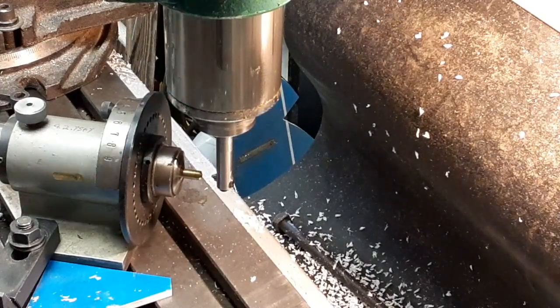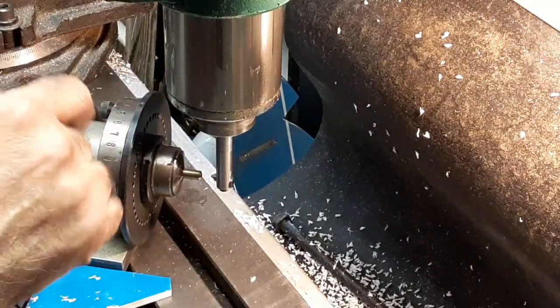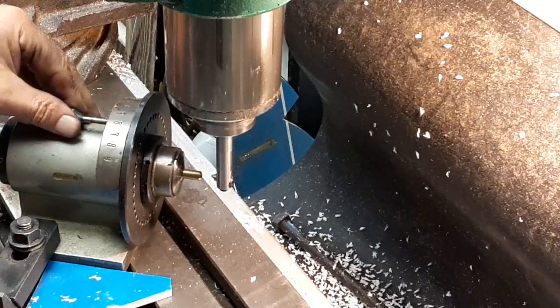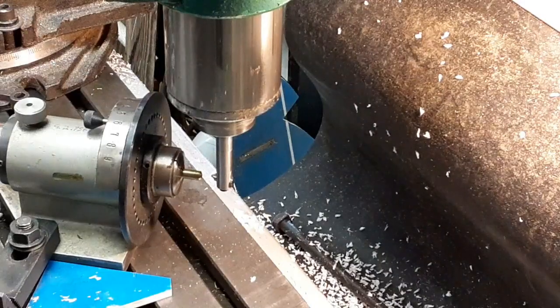And if I roll toward, I can never get that right in my head. So, if I roll toward, I want to drop. So I've got to drop 16. So, go down 16 thou, and we want to go on the half, five degrees toward the spindle. Am I doing that right? Because I think it's 1/4 of the tooth index.